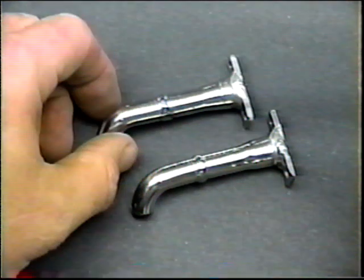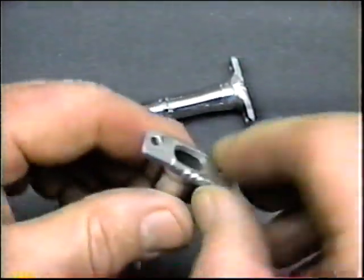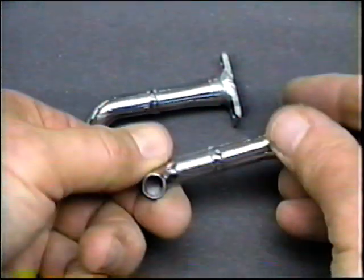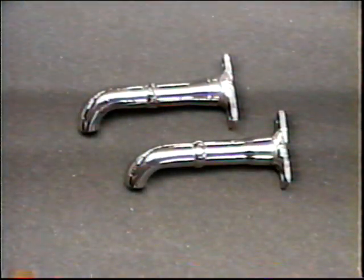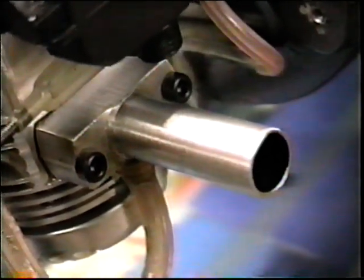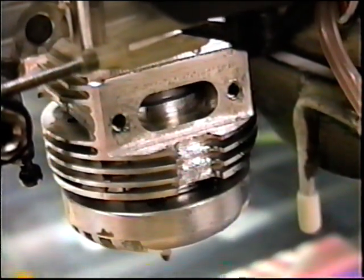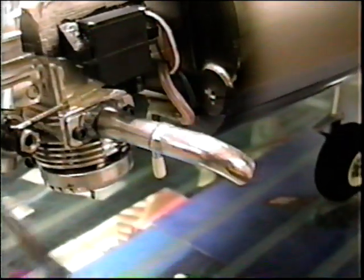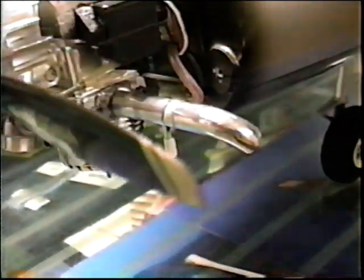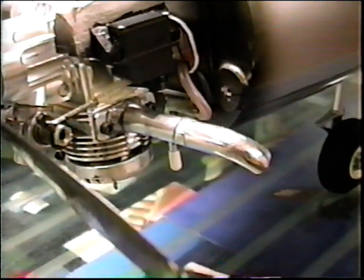Well, now we need to get the B-25, which already has the cowls off, up here and fit up the gaskets. Get this area trued up so it bolts perfectly flat up against the motor and seals up at that point. The original machine parts. Now the next thing is to make up an accurate gasket for this. It looks like it's going to work out just fine, and we'll be ready to, if we get some weather, give this a little test run.